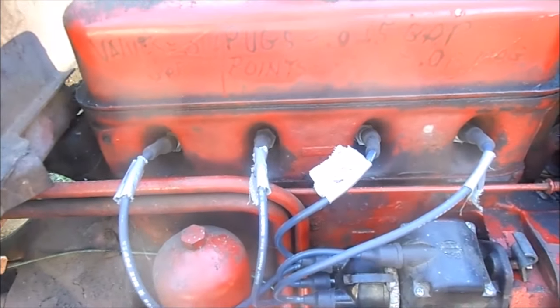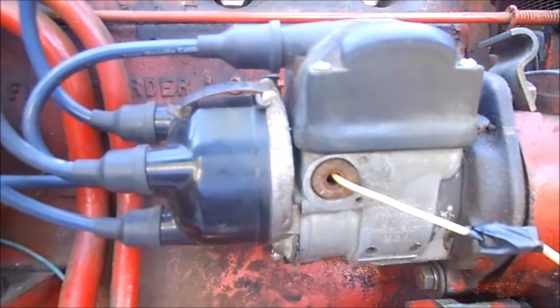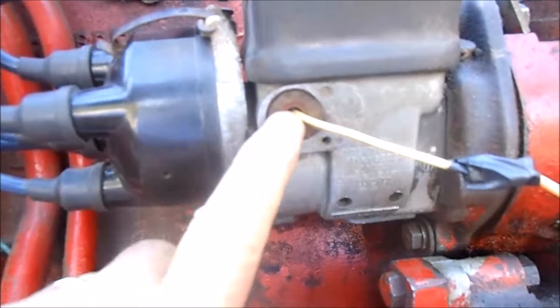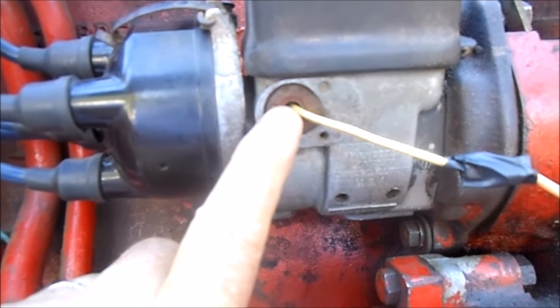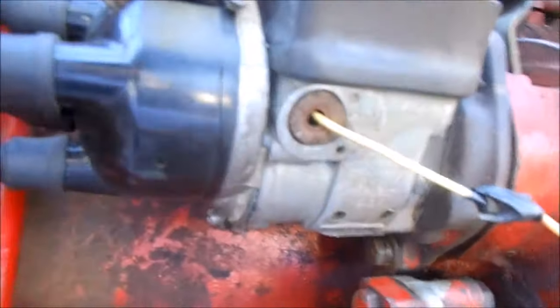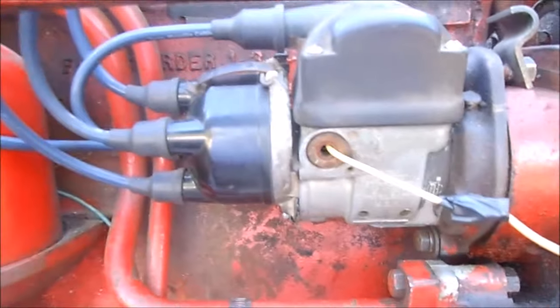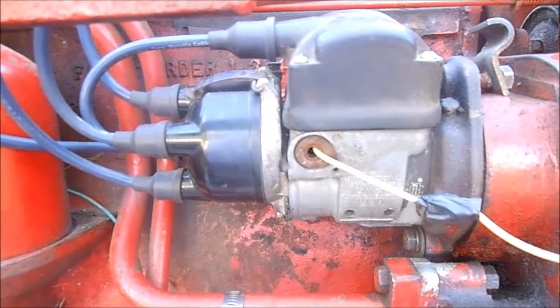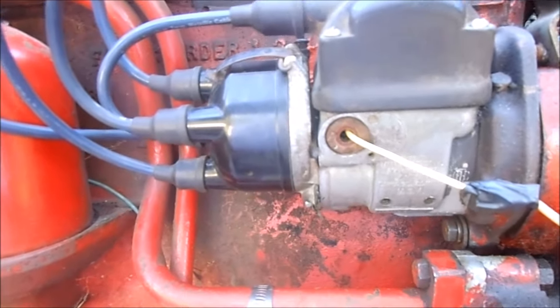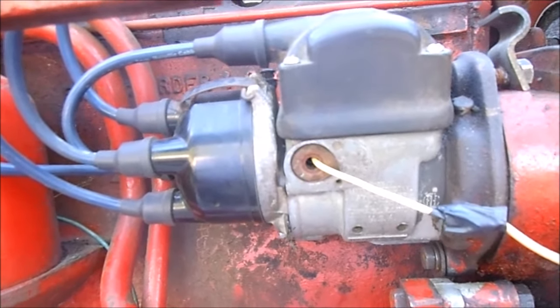As they say, you have to think outside the box — well, sometimes you got to think outside the magneto. Inside that magneto, the condenser sits right here where I'm pointing. The problem was that condenser was shorting out inside the magneto. I had this problem in the past — the coating insulation wore off. I coated it with liquid tape, which worked great for a while, but it obviously cracked and wore off again.